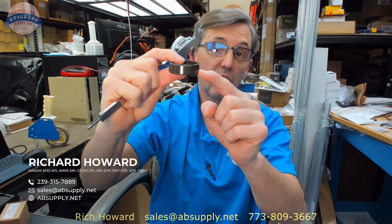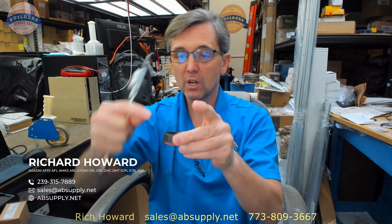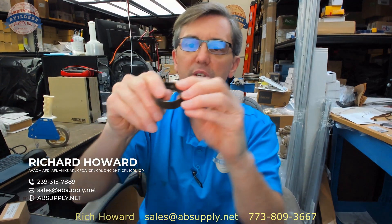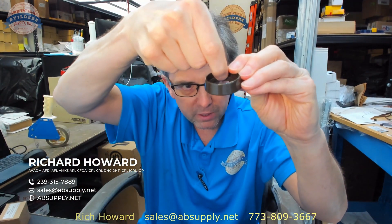The important dimension is the height of the shoulder: my caliper tells me it's 0.518 inches — just over half an inch. So how much room is really left? 0.201 inches, about 7/32 of an inch right down in here.